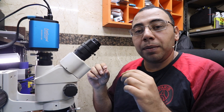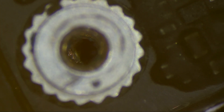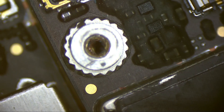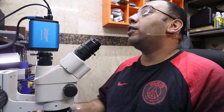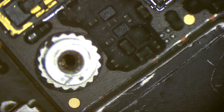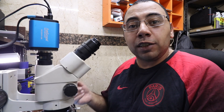Let's remove the NAND and check if it's a working NAND or a dead one. We have to use the P11F programmer. Oh my god, the board is screwed - oh my god. I can see the second layer from here. It's very dark and the camera of the microscope cannot get the image clearly, but when I look through the eyepieces I can see the second layer of the board.